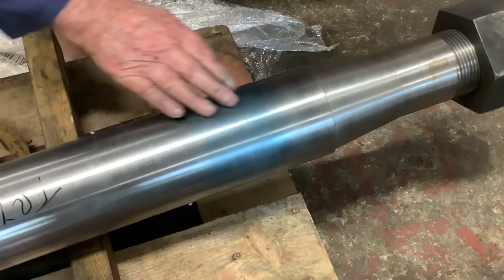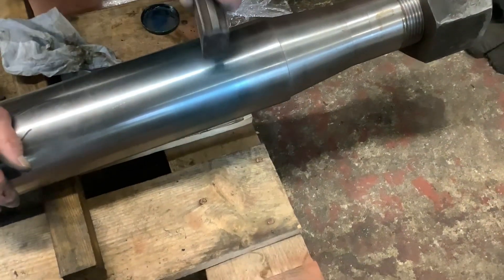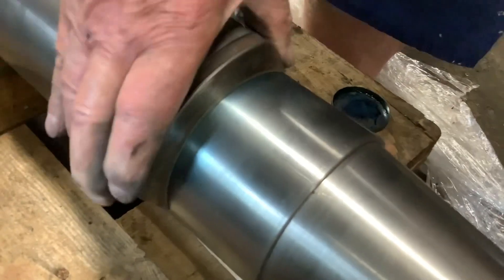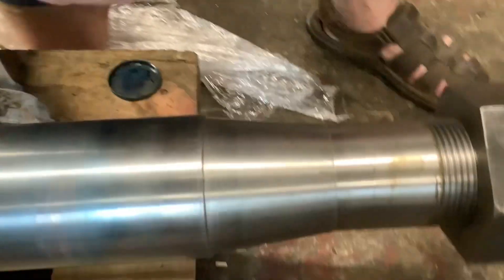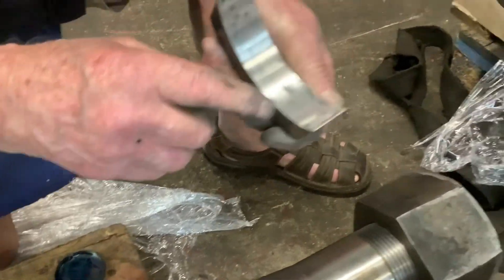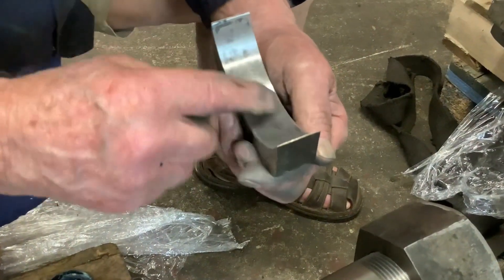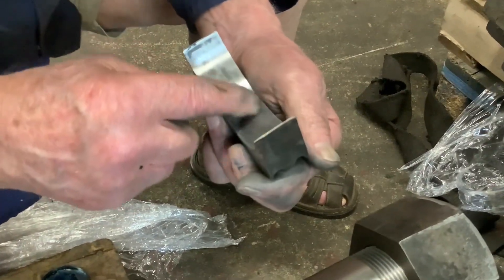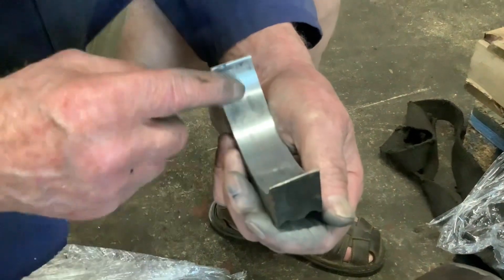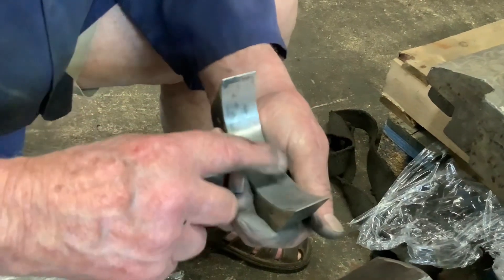So you have to reapply the blue. Yeah. Look at that — they're getting better now, see? When you say getting better, is it because the marks are getting bigger? Yeah — before we weren't getting a lot of marks over the surface, just a red mark up top. They're coming out now. So if I take these off, I'm looking to get some marks down here so you know it's touching all over. It's still appearing on the ends as well. I'm going to leave them for now and just look at those.